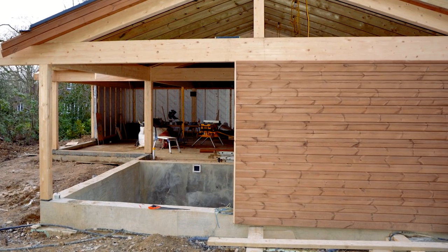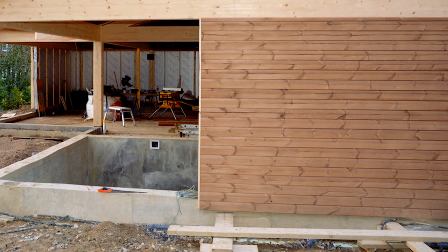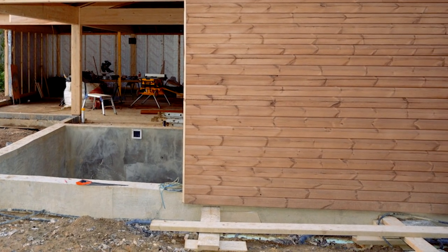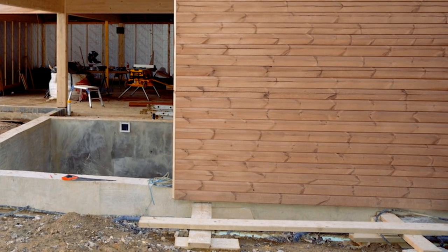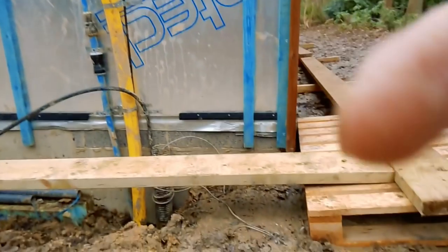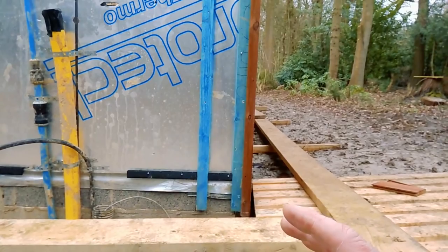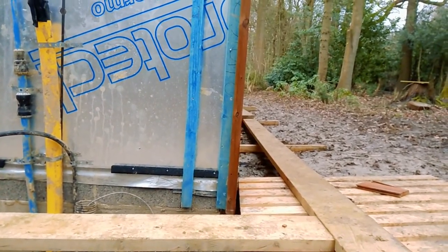A lot of people recommend up to 40mm of airspace. If you're doing vertical cladding it's fine because you'll cross-batten everything and get 50mm if you're using a 25mm batten. I'm using a 25mm batten here because I just don't want the build-up to be too big. I've actually clad the whole rear of the building and the other side — you can see the battening on there, and lower down the ventilation. You can see all my services coming up here, so I'm going to build a little housing on the outside to accommodate those.